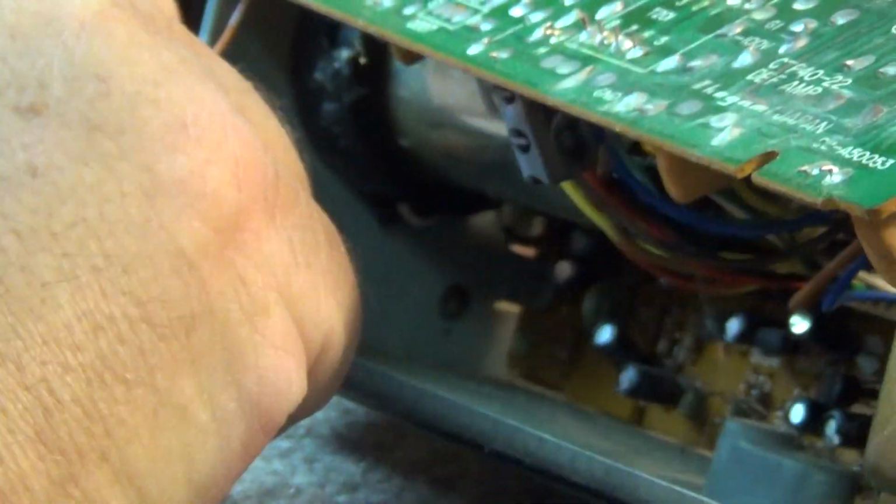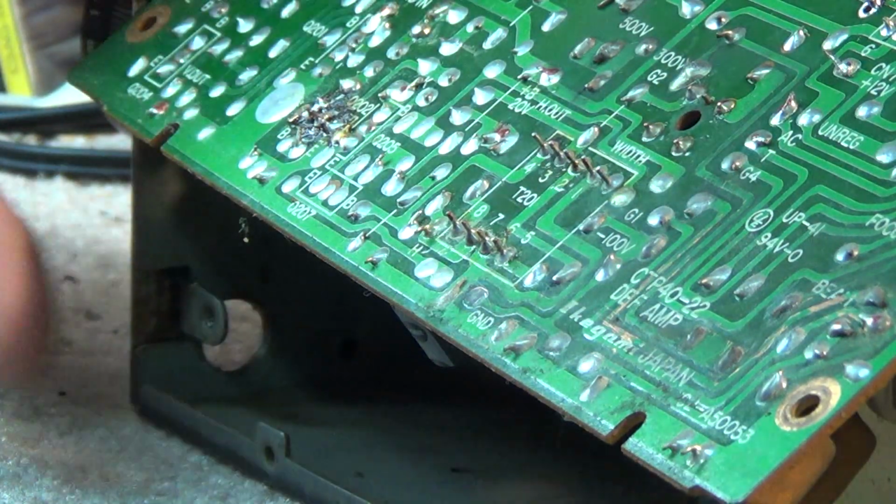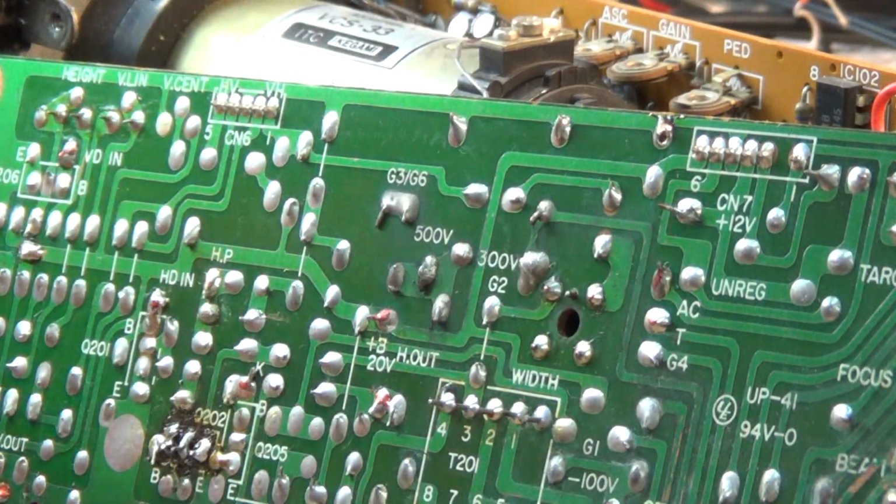LED's been stuck in the front. I think that can go. I don't think we need to have that in there anymore. Just another wire getting in the way. But yeah, we'll wait for this thing to warm up and remove that transistor and just see whether that will breathe some life back into this old camera.